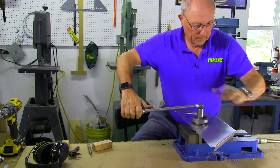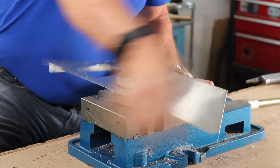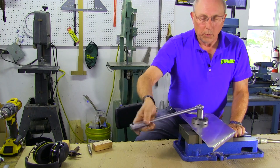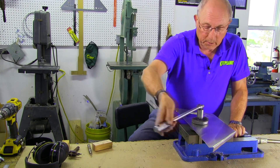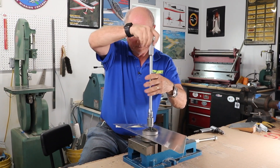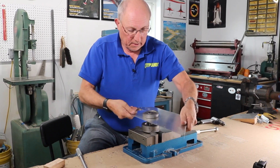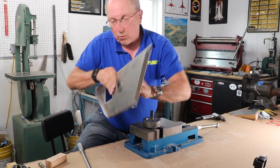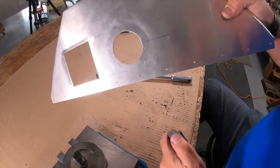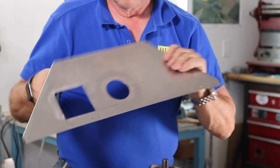So now we are just going to start cranking. As we crank this down, it is going to force that blade through the sheet metal. You can hear it pop there — there it popped again. The tooth is going through, both teeth went through and it carved its way down. Nice and easy. When you cut the larger size hole, it's going to take a lot more force just because you are cutting a bigger area. We spin the nut off — we are done with that. We pop the panel back off, and sometimes it is pretty tight so you will have to work with it. Be very aware that panel edges are sharp and you do not want to cut yourself. There we go — a perfect round hole.